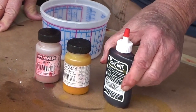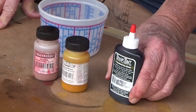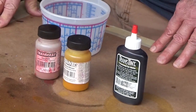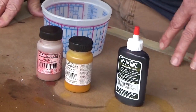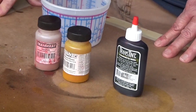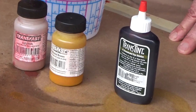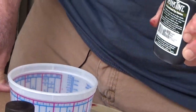Since I'm trying to get a little bit more reddish tint out of it — let's say we're in the field and we've done an entire kitchen and we realize the color doesn't quite have enough red to it — we don't want to have to go back and reapply a secondary dye over everything we've already done. What we can do to move forward and make a small color adjustment is to use this trans-tint dye from the same company.